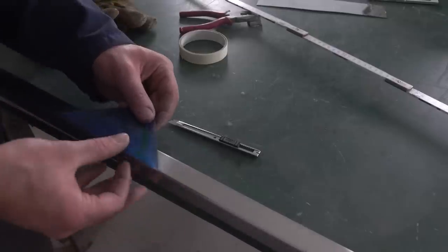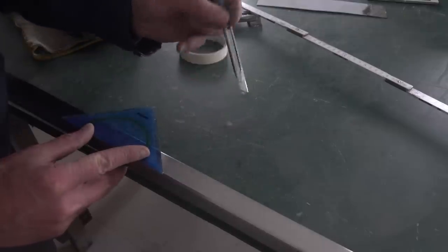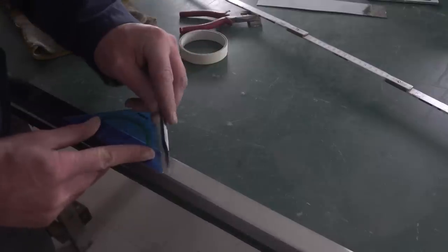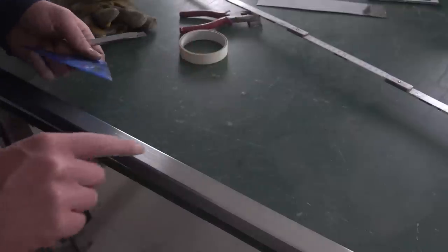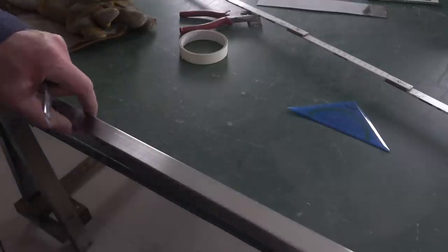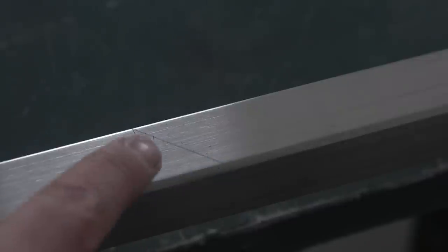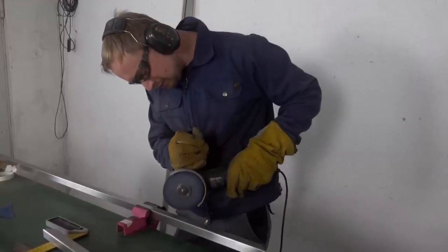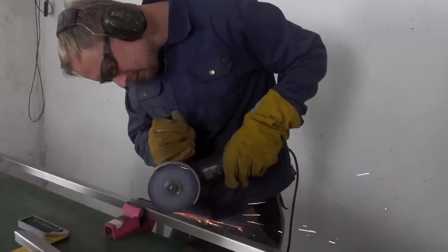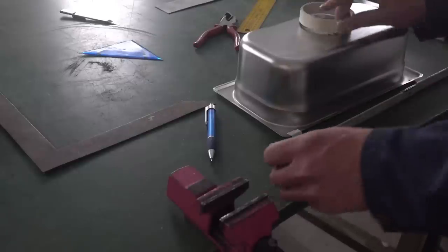I ordered brushed stainless steel so you can mark it easily with a knife or a needle. I use a cutting knife — when you use the knife you get a very exact mark, giving you a precise line to cut the 45-degree angle. I did the same for the width of the box, which I measured as 30 centimeters, so I will cut 30.2 centimeters.